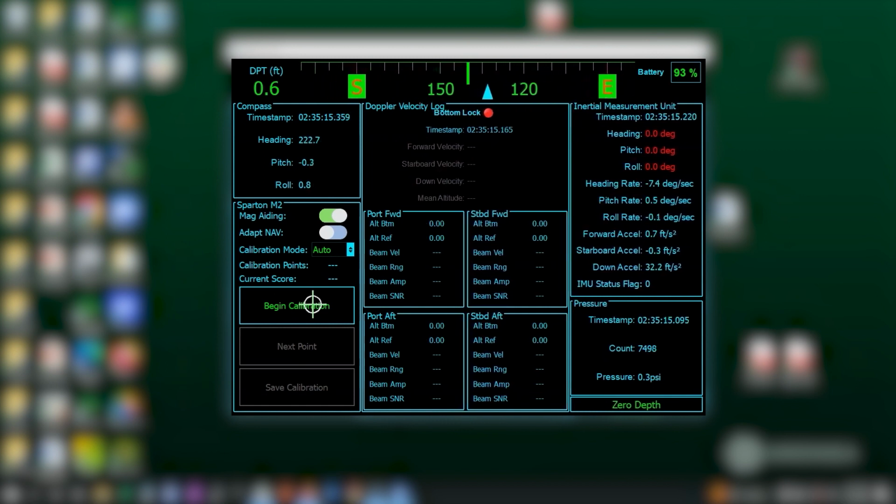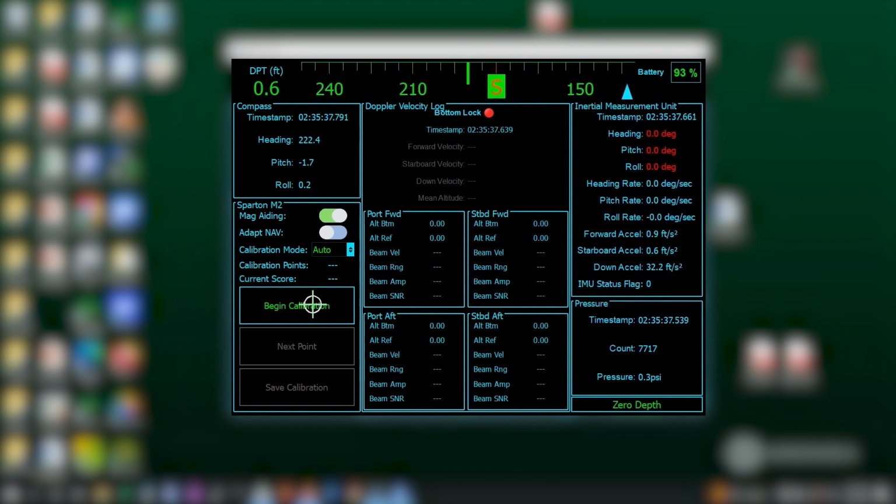Before we start, we're going to want to actually get in the water with you and your buddy on the DPD, if you're using the DPD, or just with the RNAV in handheld, and introduce everything that's natural to the dive profile to the RNAV. It does not help if your buddy is holding the equipment in the shallows while you go into the water and do a compass cal. It doesn't help if you're doing it in the parking lot or on a boat ramp, because the environment, obviously, the reinforced metal, piers, pylons, and so forth, are going to have an effect on the compass.